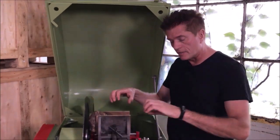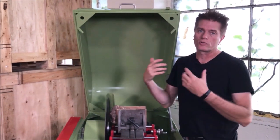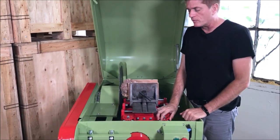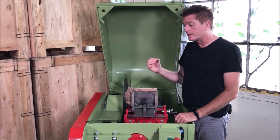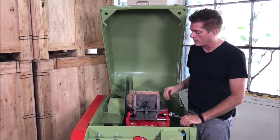It becomes sloppy. That's a classic design on the Bronco saws, because they run on tubes in a gritty environment, they get looser and looser and looser. So you can't maintain the tolerances. Again, that's why we go with this bearing design. And that's really what made the Highland Park design ever since 1962, when that design came out. It really became the standard for, oh yeah, I want the best. It's going to be a Highland Park carriage.